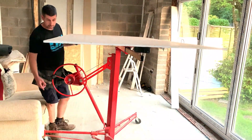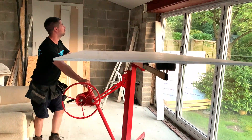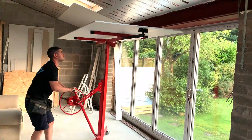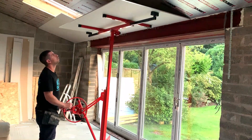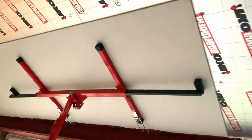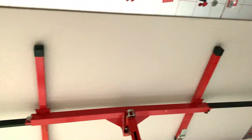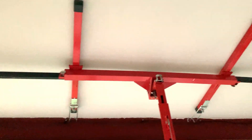Make sure the supports are in contact with both ends of the plasterboard and it's roughly central. Normally you'd lock off the casters and unlock them at this point, but I wedged it against the couch so I didn't need to. It is fairly maneuverable — it helps if you've got a lot of space. I crank up the wheel and that holds the board up against the ceiling. Now I can get my chalk line in and ping my centers and screw it while the lift holds it in place.